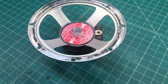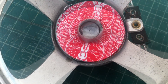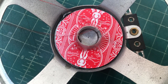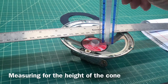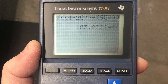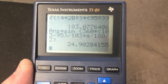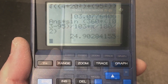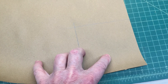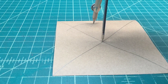Here's a dry fit of the spider I created around the voice coil, with shims placed. These old speakers have a very narrow gap — I could only fit two shims in, so hopefully that won't compromise quality. There's a lot of great information online on how to create your own cone; Nostalgia Air has one dedicated to speaker cones, which I'd recommend. Here's the math — I pulled out the old TI-81 for the first time in a while and plugged in the formulas, keeping everything in millimeters for simplicity and accuracy. I cut craft paper to about 120 millimeters, created a square with an X pattern to find the center.